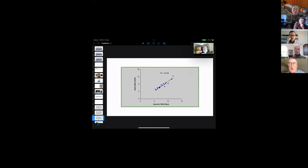If you look at materials, most people assume, if you follow density, that it is a shorthand for the stiffness of the material. But if you actually look at it, density is a poor measure. In this diagram on the right-hand side, the bottom is the density, going up the side is the static modulus of elasticity, or the deflection of the material, and the line is the regression for density and stiffness. So if you're using density as a substitute for stiffness, you're not getting very close to an accurate measure. If we look at the speed of sound, the regression is a little bit better.